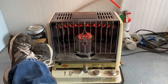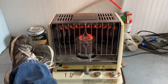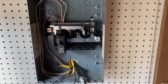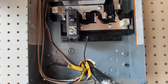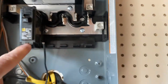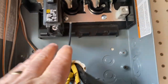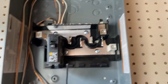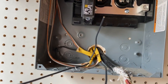I'm going to let this warm up and head to the back to do some wiring. I'm not going to show the whole process again — this is entertainment only. I'm not an electrician so seek a professional if you're going to do any of this. Basically what I'm doing is putting breakers in and running my hot wire up into the screw here. I'll do that systematically and label them. Right now I only have to put two in — left and right side of the bus.